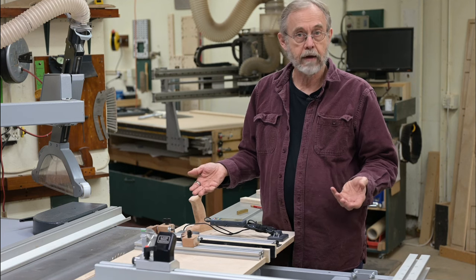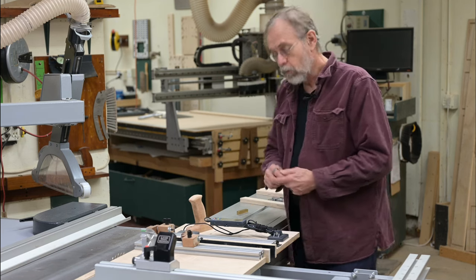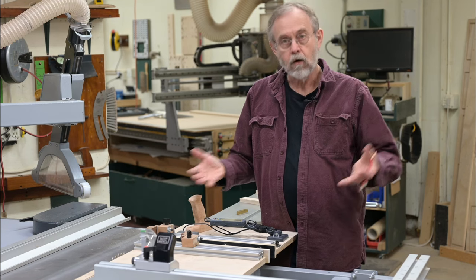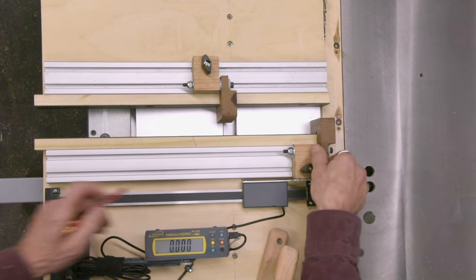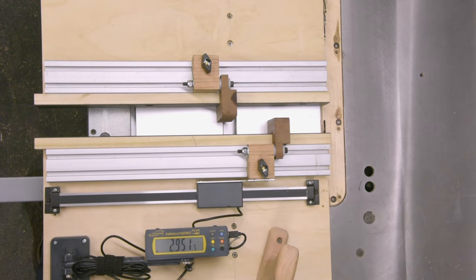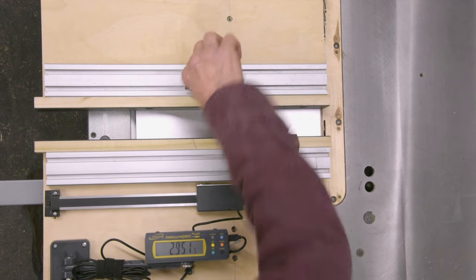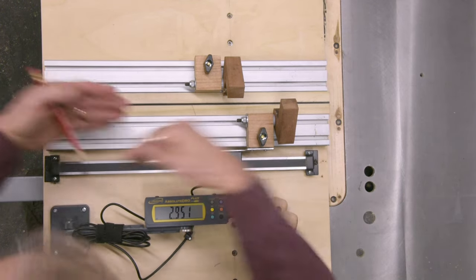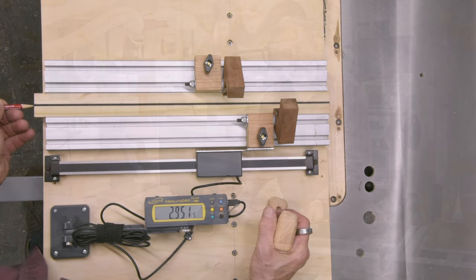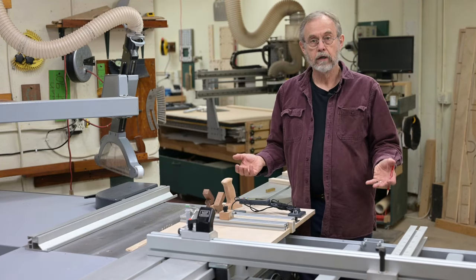The DRO's stated accuracy is 0.0015 and I wasn't getting anywhere near that. What I did was go back and readjust things. I found that this part wasn't the same distance in one spot as it was in another — not very much, just a slight bit — so I recalibrated that and got it a little closer. Also on the initial setup I was really close, with things touching both surfaces all the way across, but right here there was just the slightest bit of gap, so I worked that out too. Once I did that I started getting really good results.